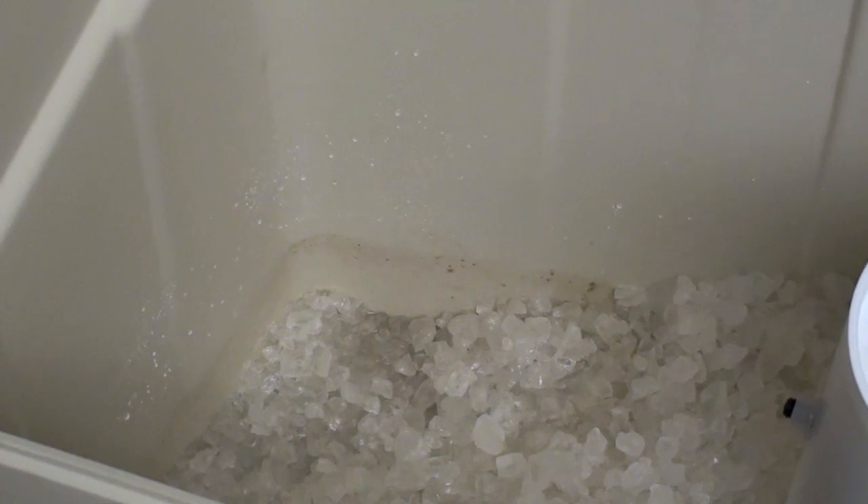I'll give you a brief explanation of how water softeners operate. The resin in the tank, when it comes in contact with salt water — sodium chloride — the sodium ion sticks to the resin beads and gives them a weak positive charge. Iron, hardness, lead, cadmium, and zinc all have a stronger positive charge for the resin. So the iron or hardness sticks to the resin in the tank, and then a sodium ion is released into the water. It's called ion exchange — cation exchange — which means it's exchanging positive ions. Essentially, the hardness mineral sticks to the beads and exchanges for the sodium ion, which is released into the water.